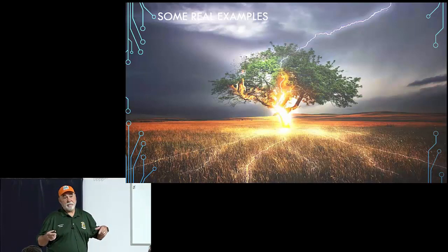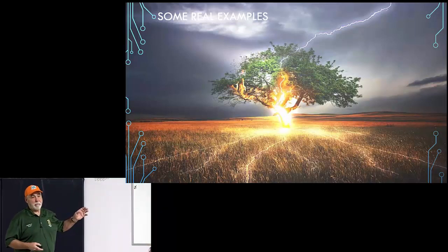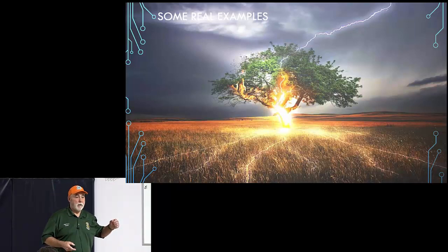And then the other thing I've done is I've made up about three of these little jumper cables. It's got alligator clips on both ends. So if I'm going to bring in a piece of gear and just temporarily put it in the station to work on it, then I'll clip it into the common bus bar. So that's the other thing I do. Making sure every piece of gear is connected to that bus bar is really important.